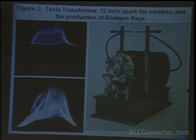Those are hard to see in the photo. But the vibrating spring itself, the sole function of which is to cause periodic interruptions, can be adjusted in strength as well as the distance from the iron core in the center of the charging coil, and by four screws visible on the top plate so that any desired conditions of mechanical control might be secured.